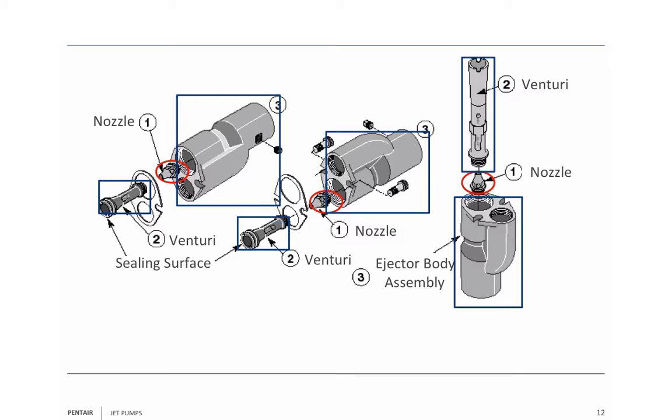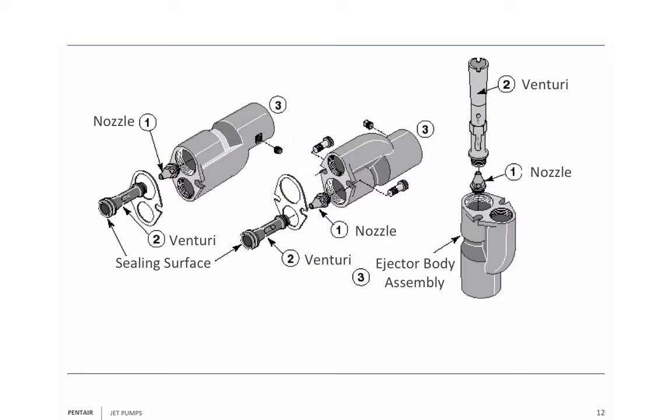The vertical picture is deep well. The middle picture and the far left picture are what we call shallow well jets — they attach to the front of the pump in a horizontal position, so they're good to about 25 feet. The picture on the right is a deep well jet, and deep well jets can go considerably deeper, depending on the horsepower of the pump and the nozzle and venturi combination. It's very important that you use the right jet with the right pump — using a jet that's already in there may not work.